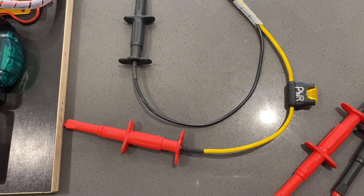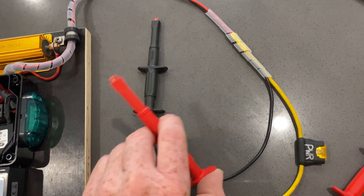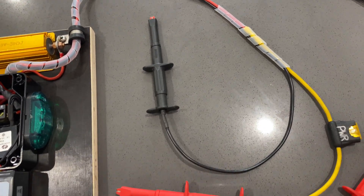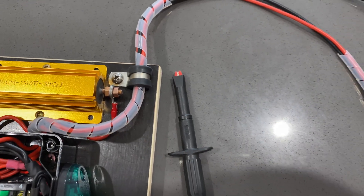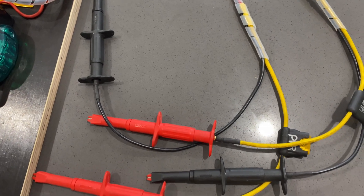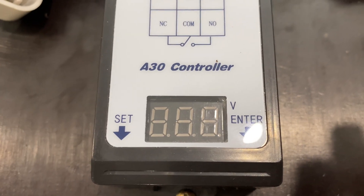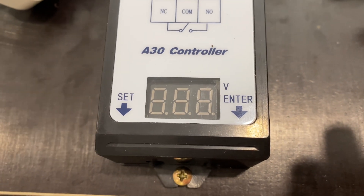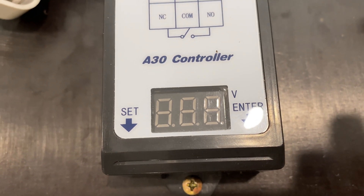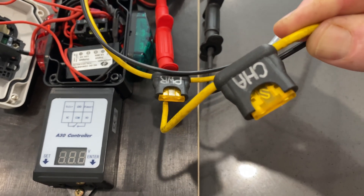The start of the pre-charge circuit is here with the power cables — you go into your battery, clip on your negative then clip on your positive. The gauge there just gives you a good reference, you can watch the voltage climb. It slowly feeds in — it's quite handy, charging up those caps so you don't get a huge inrush of current.